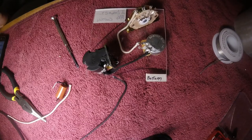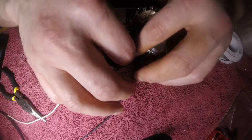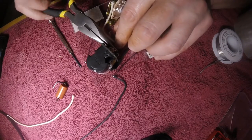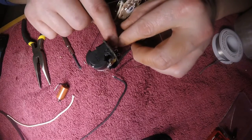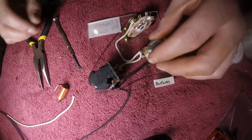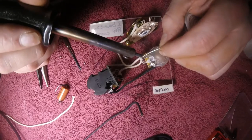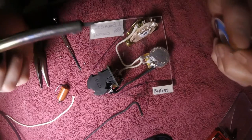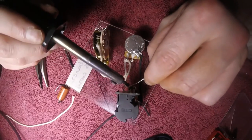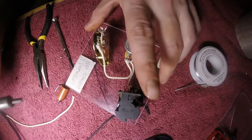I'm not going to solder that one quite yet because it has a second wire that comes off of it, going to lug two of the tone pot. So I'm just going to stick it in there, push it against the jig tight, and bend it where it needs to be bent — get it right up in there in lug two. Take a little solder, heat up the whole deal, make sure you get a nice good conduction. Come back over to tone, lug two on the tone knob, give it a little heat, make sure there's a good connection, and pull on everything. We're almost there — we've only got two wires left in the tone pot.